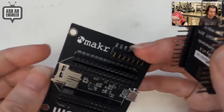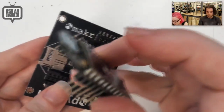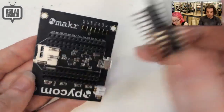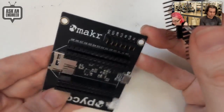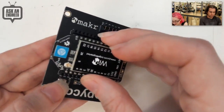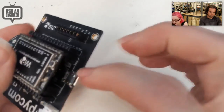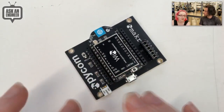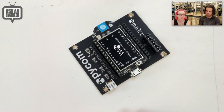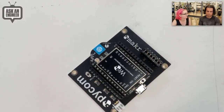You can plug it into this evaluation board. The eval board gives you a micro SD card for file storage. It has charging LEDs, I think a sensor or two, a button, and a USB serial port. You can connect through USB serial to type on the console — just type into the Python REPL — but it's designed initially to be done completely wirelessly, so you write your code completely over the air.